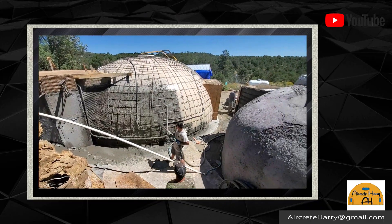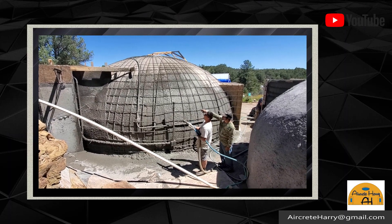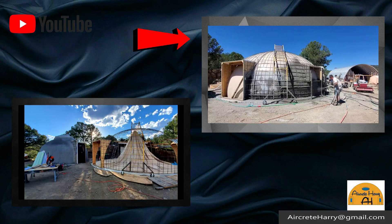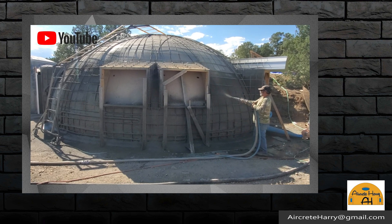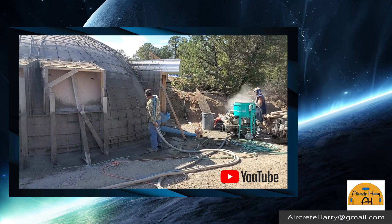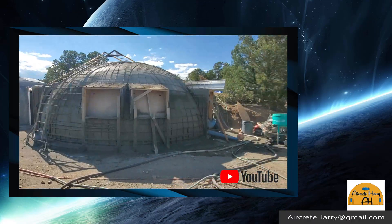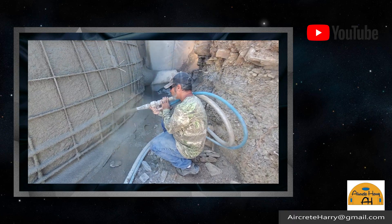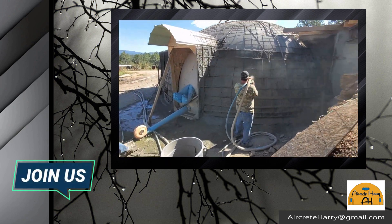I didn't run this rebar on this dome, and you're going to see later there was one issue. You can also see the electrical conduit that was run on it, which was really great. We made a custom ladder for this dome specifically so that we could apply the cement to the top portion of it — that's the ladder there that swings around. All the window and door framing you're going to be learning, you can see the electrical conduit we've run, and all that gets embedded into the concrete. The one issue with the rebar is that spacers weren't used under it to keep at least a one-inch gap away from the air form, so that becomes a pain later because once the air form is removed you have to cement the inside with a trowel to cover it all up and strengthen it. We won't be making that mistake on the dome we're going to be working on in Colorado.